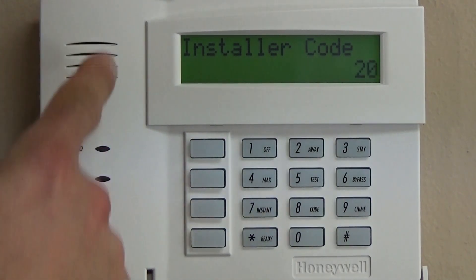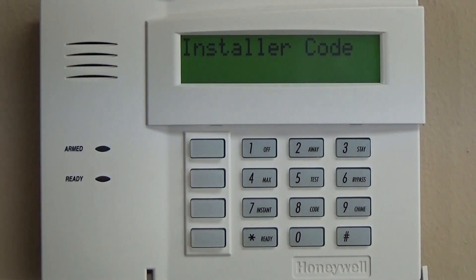The distance for these is typically pretty good, but in some larger houses — 5,000, 6, 7, 8,000 square feet — you want to try and centrally locate that receiver to reach the furthest contact instead of biasing it towards an entry door and having the entire distance for the wireless contact to try and talk back to this.